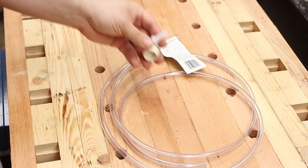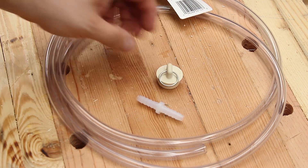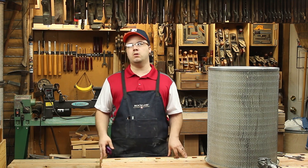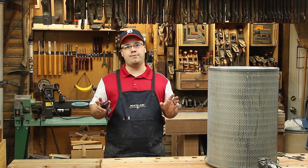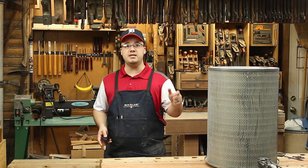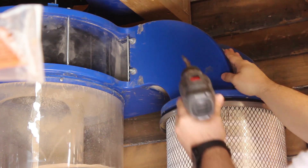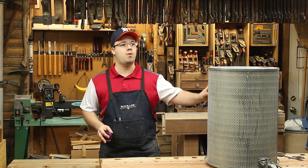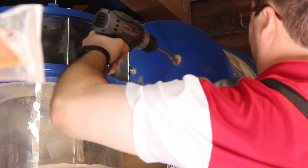Let's build one. You're going to need a few feet of quarter-inch vinyl tubing, a nylon double barb which fits inside that tube, and a rubber stopper — like one of these old sink stoppers you can find at home centers — plus a few other miscellaneous things we'll get to as we go. First, you have to drill a hole in your dust collector. It's not a big deal — you can pull the plug back out if you change your mind. If you have a cyclone, put the hole in the transition between the blower and the filters. If you have a single-stage collector with a large cartridge filter, put the hole right in the top.